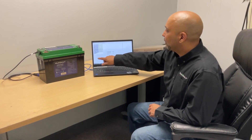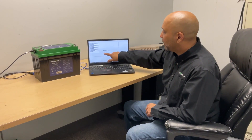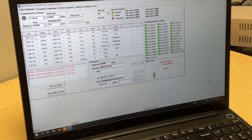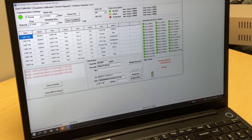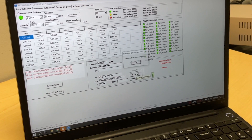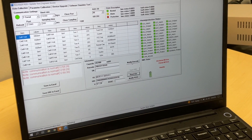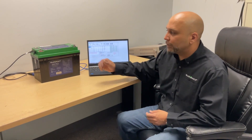The upper computer has stopped updating and the battery was successfully updated. It will display 'Upgrade Complete' right here. Once you get that notification, go back into your data collection, refresh the connection to the battery, and you'll see that your firmware was updated and battery communication is normal. The battery took the firmware and now you're ready to use it. That's as simple as it is to upgrade the firmware on the HLX series batteries.